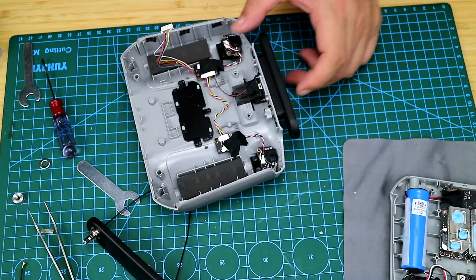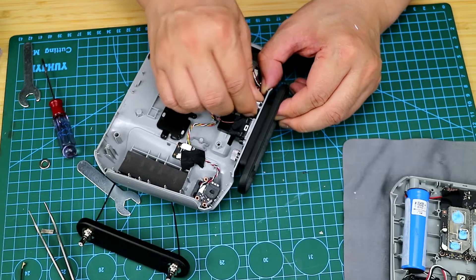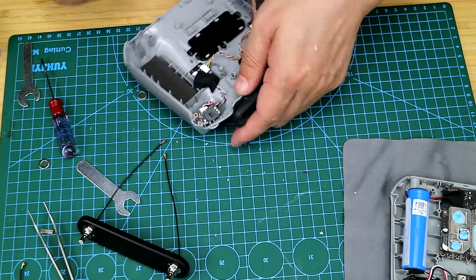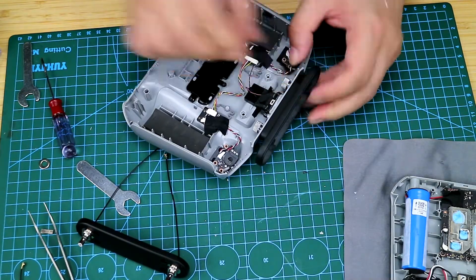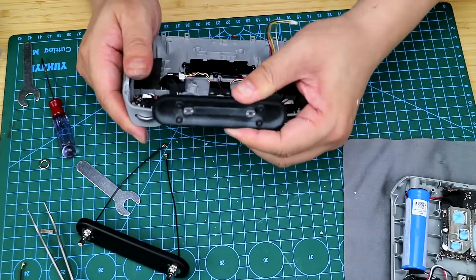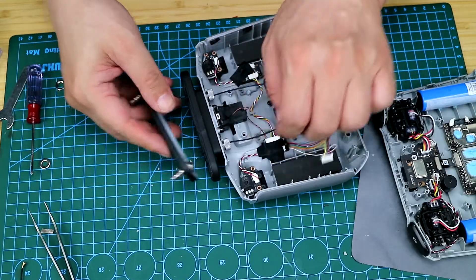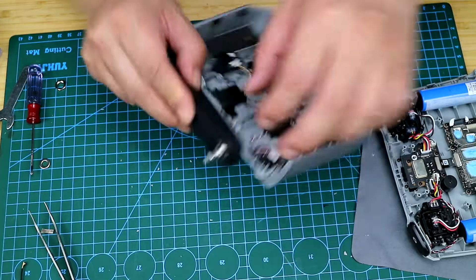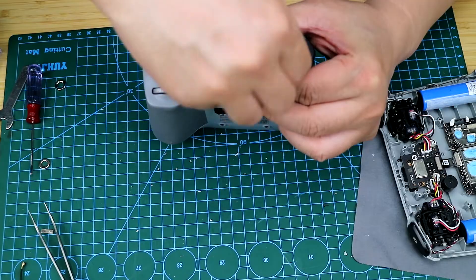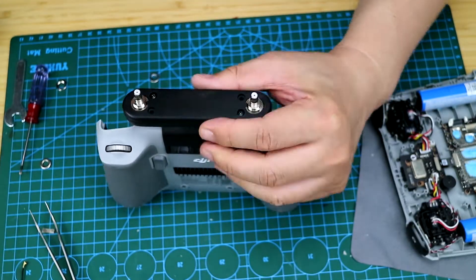Then we install the cover with the feeder wire. Pass the feeder wire through the hole of the fixed shaft. After fastening, we can use a screw to secure it. We should take care that the internal feeder wire should not be bent at 90 degrees, otherwise it will damage the feeder wire. RF feeder wire is a kind of coaxial cable. If its shielding layer is damaged, the signal will leak and affect the transmission quality of the signal.